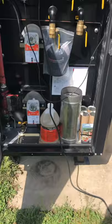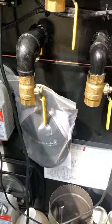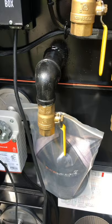On the back, we now have a standard one-inch port and an inch-and-a-half port. If you need to run more than two circuits, you just T in — take the reducer elbow off, put on a straight inch-and-a-half elbow, then a T, so you can flow three pumps if you have to.